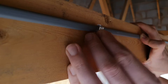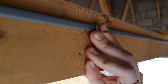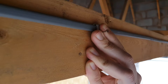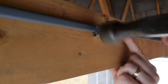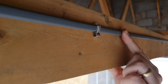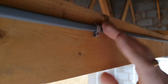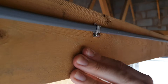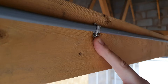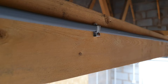It's simply a matter of offering the clip up into position, holding it in place so you don't accidentally drop it, and then giving it a little tap. As you can see, that has really gripped the cable quite nicely and tightly — as well as a plastic clip would do. So we can be sure that should a fire break out along here, that is not going to melt and the cable is not going to drop down.